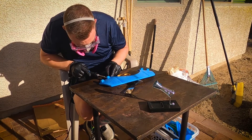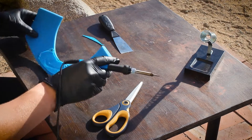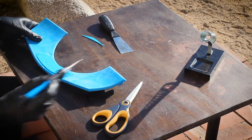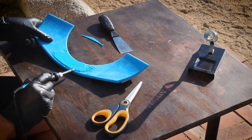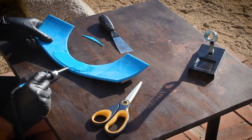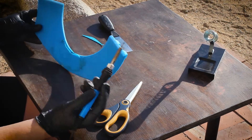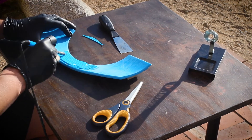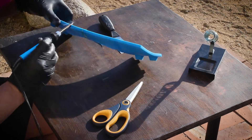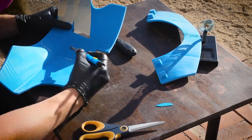However with this collar piece, when I was heating it up I kept having issues with it trying to bend in half. That's the one thing you want to be careful of. I'm using PLA+ and if I get it too hot it may start to warp and melt. When it started to melt in a way I couldn't control it began trying to bend in half. Because of this I actually took a large raft piece, cut it to size, and welded it into the back — completely melting it down and smoothing it all on the inside of the collar piece. Because of that the collar is extremely strong and won't have any issues bending or breaking in the future.